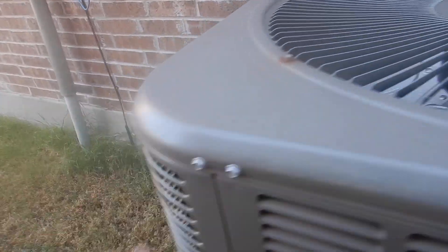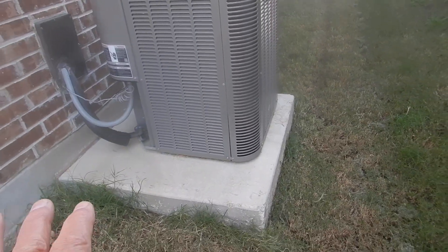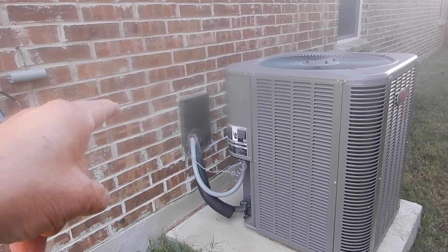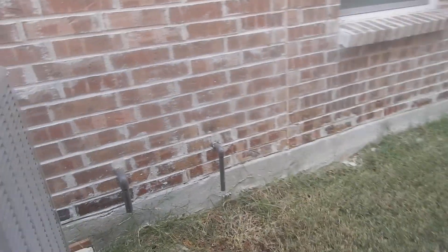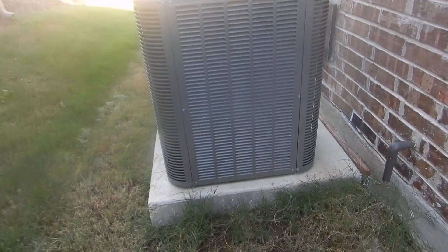It is properly fused. However, we've got a leaning condensing unit that's too close to the wall, the refrigerant piping penetration into the exterior wall is lacking, and it operates on 410A. You need to find out whether you have a warranty on this or not.